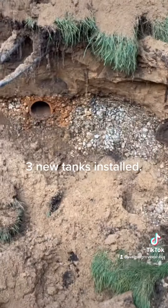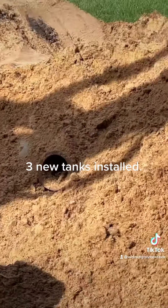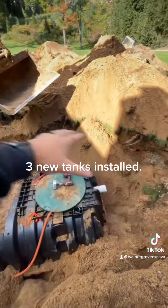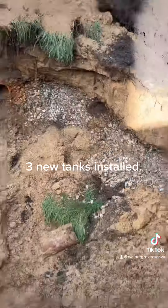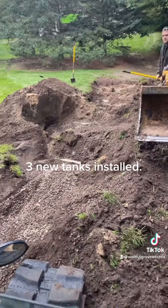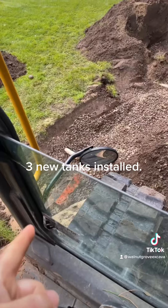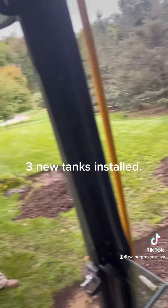You can see the 12 inches of stone and the old clay tiles — original system. Used to be one tank here and then it went into the drain field. The drain field looks fantastic now; it's had many years to dry out. We are doing the drain field — these are the six laterals. We're going to put some clean-outs on it and do the pressure test on this one. Then we'll go back and start digging for the second tank and let these guys do their thing.